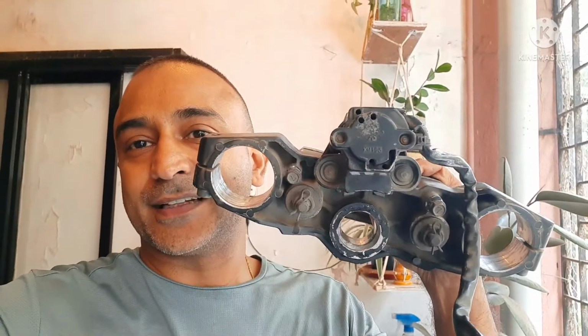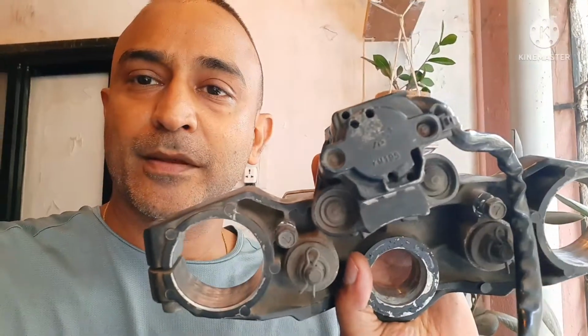Now, what I figure out is that these are breakaway bolts, so I will have to buff off the head of the bolt, and then only I'll be able to take it out, disassemble it. The problem that I will face is once I buff it off, I will have to try and pull the old bolt out, and hopefully it's a bolt, it's not a one-piece unit. If it is going to give me a problem, then I will have a problem at hand. But what I figure is, I think these are breakaway bolts. So once I buff them, I should be able to remove the top unit and use pliers and things like that to pull the bolt out, twist them out and take them out. And let's see how that works.